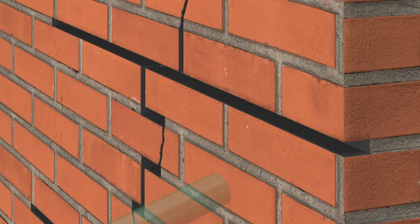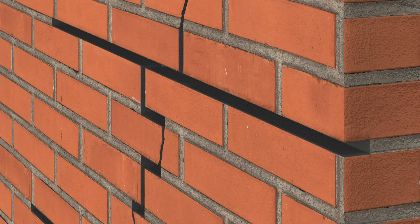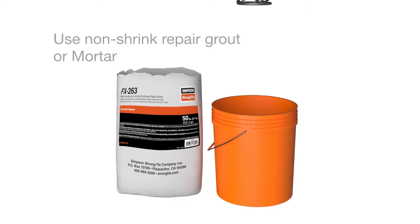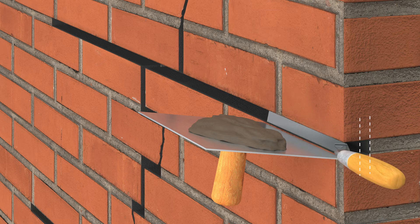Flush with water to clear all loose debris and saturate the bed joint. Next, mix FX-263 Rapid Hardening Vertical Overhead Repair Mortar per product instructions, and trowel into the bed joint, filling the void to approximately two-thirds of its depth.